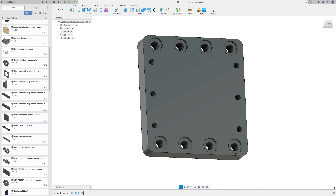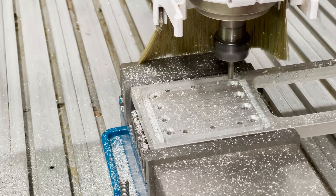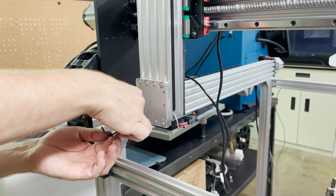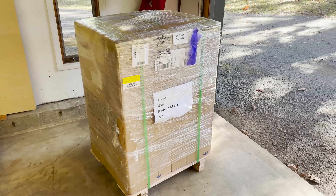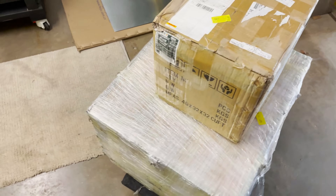Next I designed a mounting plate that would attach the laser head to the Z axis extrusion. I go ahead and get that part milled out of some more aluminum plate. With the mounting plate finished, I get that installed on the Z axis — I'll adjust it into final position once I get the laser head. And speaking of the laser head, a bunch of components just arrived from China. That's going to be too much to get into right now, so I think I'll stop the video here and we'll get into components next time.